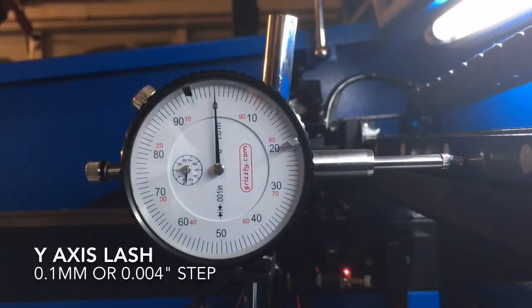I've had some trouble with this machine cutting clean circles. It has a tendency to flatten the tops and bottoms of the circles, or chamfer the edge at around 10 o'clock. It was suggested that maybe there's lash in the y-axis. Currently the machine is set up such that the y-axis beam is 2 millimeters down from the zero origin, and I've configured the machine to move in tenth-millimeter steps, which is 3.9 thousandths of an inch.